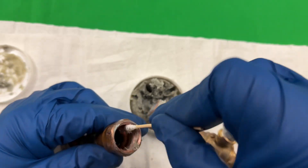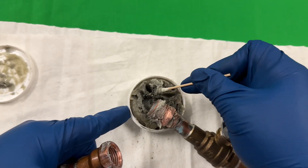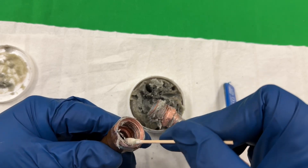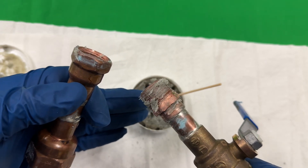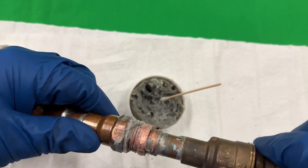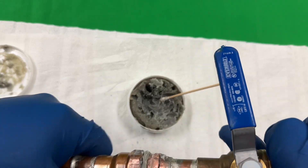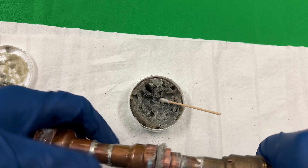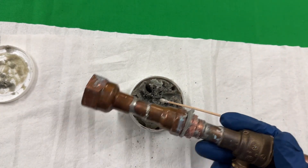Get that swirled around a little bit. I have no expectations or hope for this — I just want to know. Let's put a little bit around this rim here. That's a lot of flux. So let's screw it together, but I'm not going to tighten this with a wrench — only hand tight. It's a threaded fitting, and if I cranked on it with a pipe wrench it might seal on its own. I'm going to wipe some of this flux away and hit the torch.